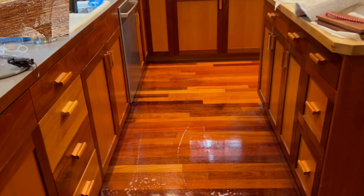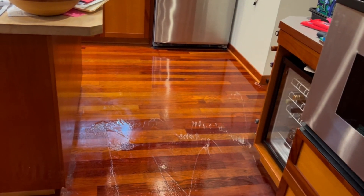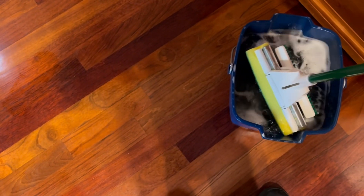You can see this is just some of the slurry — there's a lot of it. Not only the wax buildup, but there's also dirt. You put that stuff down, we mixed it for heavy, heavy wax, and then we sponge mop it on. I wait eight minutes, let it emulsify. You can see it just breaking down like gum. That area up there has been wet mopped — we squeegeed it and wet mopped it to get the product off the floors. And then here we'll be scrubbing it up, squeegeeing it, and then mopping it.